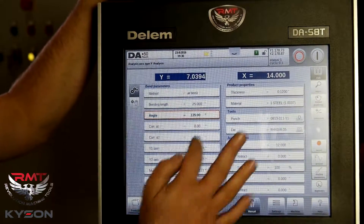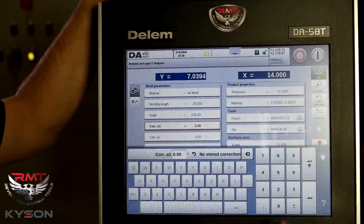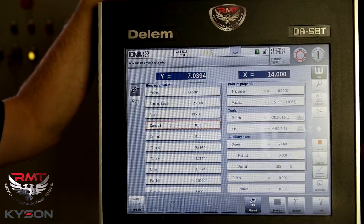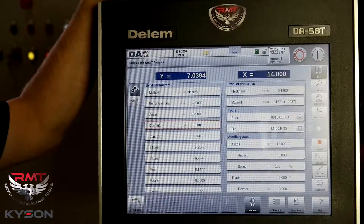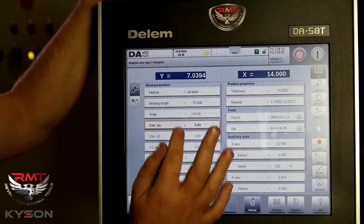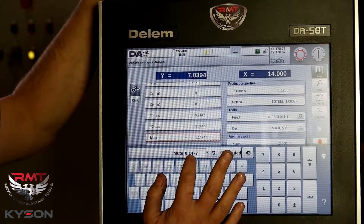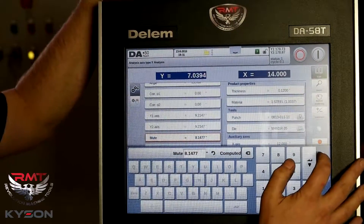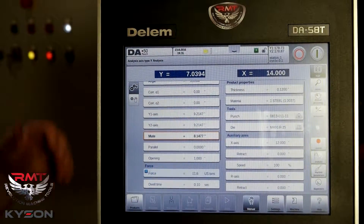I've got corrections here. If I bend this material on these V-dies and I come in and I'm one degree open — say I'm at 136 — I would put a negative one right here and it's automatically going to correct my penetration depth to correct for the inconsistency. The machine will repeat, the control knows, but you get different grain directions, maybe the material thickness isn't exactly what we put in there, the yield is a little different than what's in our library. Again, we can correct for it very quickly. Mute point — calculated off our bottom die to mute our laser. It has a safety laser, and you've got a rapid and approach speed, then you go into bending where it shifts — that's where your mute is. If the machine is equipped with a safety laser, which we prefer, it'll unmute the laser at this point of penetration.